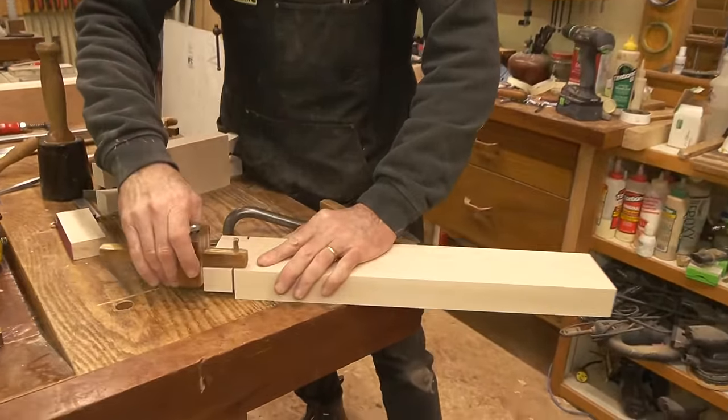I'm going to do this in two passes — it's a big lop, and if I chopped all of that at one time my chisel would probably jam. I'm going to set it right in the knife line, give it kind of an inward cut, and try to be right at 90 degrees, slightly inward. Then I'll use the chisel to complete that line in both directions and clean that material up right inside. This is where you can't leave any extra stock or it's going to jam up when you try to fit the dovetails.